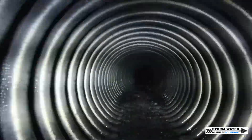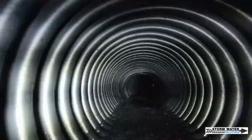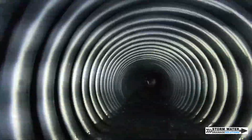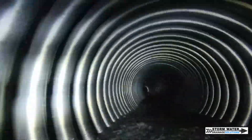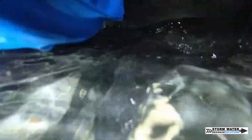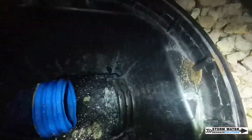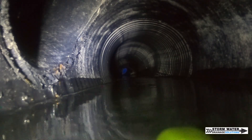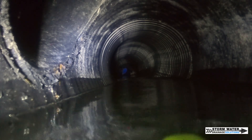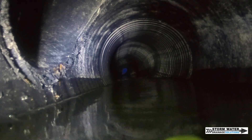What I did for the discharge end was I installed a 6-inch percolation tee around a large dry well. That way it can control that runoff water so I'm not flooding out the street in front of me. This does a pretty good job at controlling that water from what I've seen based on all the heavy rains that we've had so far. And it has been through two hurricanes and it's functioned very well. Because this drainage system discharges on a percolation tee, the very end of it builds up with too much water.